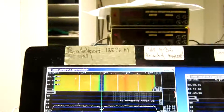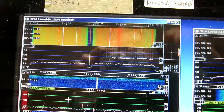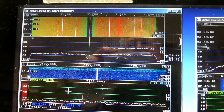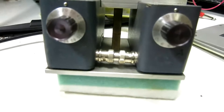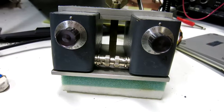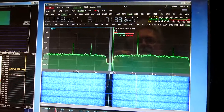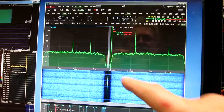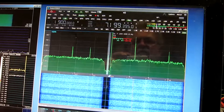In the waterfall we have some occasional interference. The reading on the attenuator is 21 dB. I can also see on the Colibri that it has some interference problems. I listen to that — it is problematic with the AGC here, which I will have to investigate. I have disabled the AGC and set fixed gain.